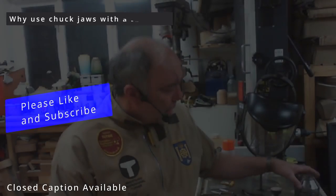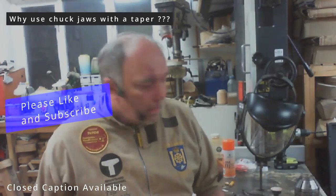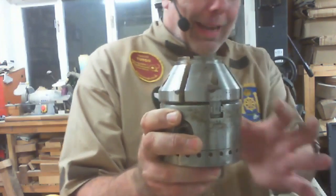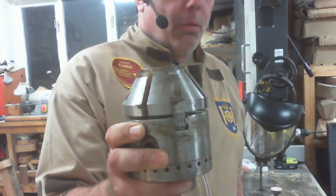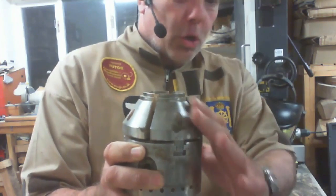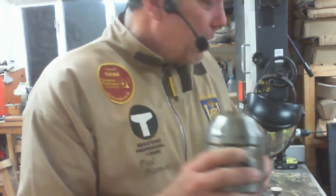I like the clearance from the shoulders — when you're turning, you have lots of room with your tool. You can see there the whole set of jaws and they taper in. I've got a four-inch chuck there, inch-and-a-half jaws, about 40 millimeters. So it gives you good clearance at the edge here — that's one reason I like them.